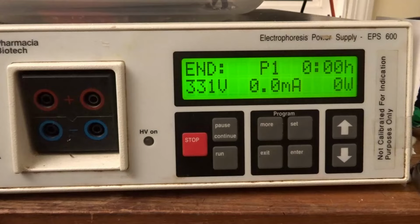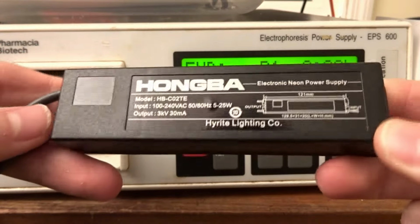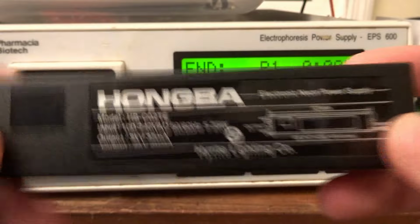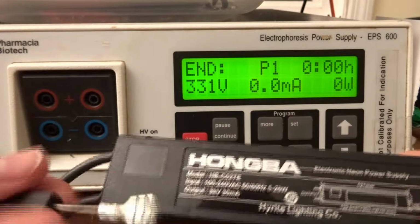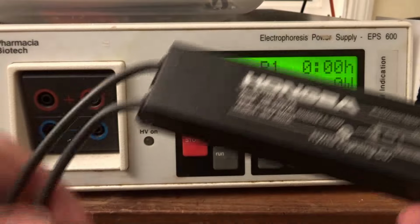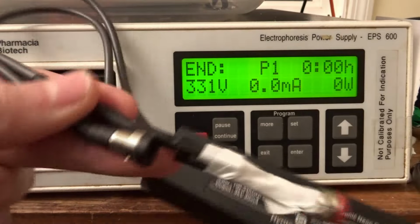A much better option is a neon sign transformer and a diode rectifier. Even a modestly sized NST and a single high voltage diode will work and cost a fraction of an electrophoresis supply. To be sure, they are not as safe, and there are some other things to consider. But we'll get into NSTs in the next video. For now, the caps are charged with this supply.